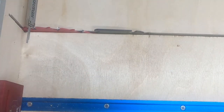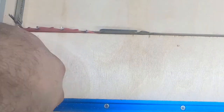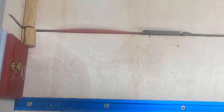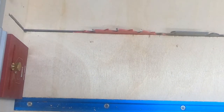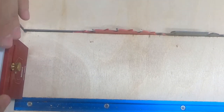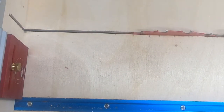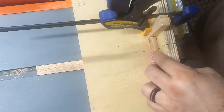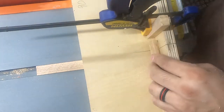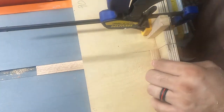And now, an exercise in futility. My first thought was to cut all the dowel pieces with the crosscut sled on the table saw — this was not a good idea. It kept tearing out the dowels, and in a couple instances it shot the piece out, luckily away from me. Moral of the story: don't make really small cuts on a crosscut sled without a swing stop. Instead, I end up using a handsaw with a 90-degree guide to get all these pieces cut. This was far safer than the table saw, and actually did not take that much time at all.